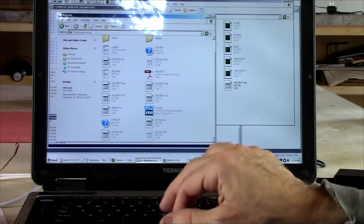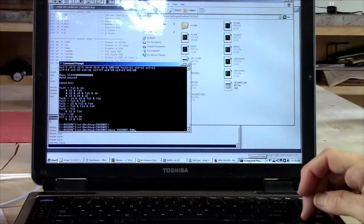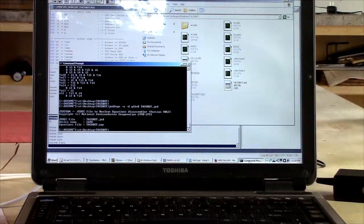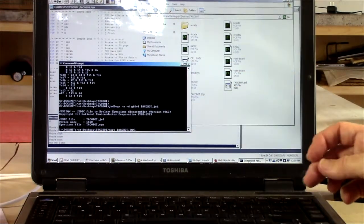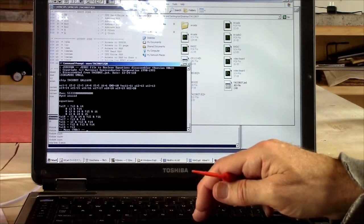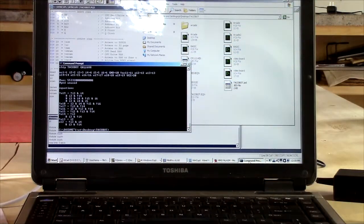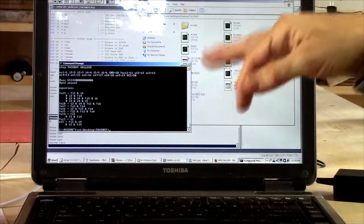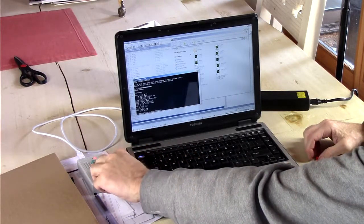And then I have this program that I downloaded as well, which is called JED2EQN, which you can use to verify that it's done it right. So that creates a .eqn file, and then we can view that, and you see the equations, and they may look slightly different than what I entered because it munches them around a little bit, but I can assure you those are the correct equations. So now that we've compiled it and verified it, now we can burn it.